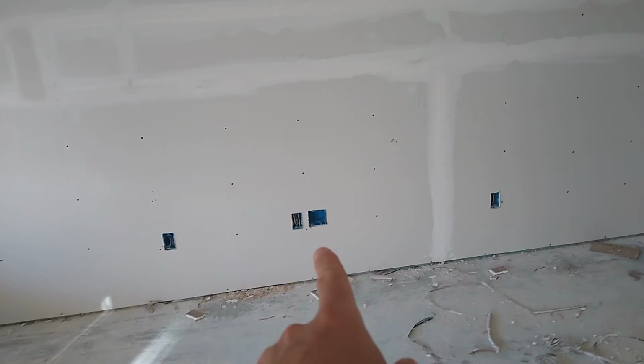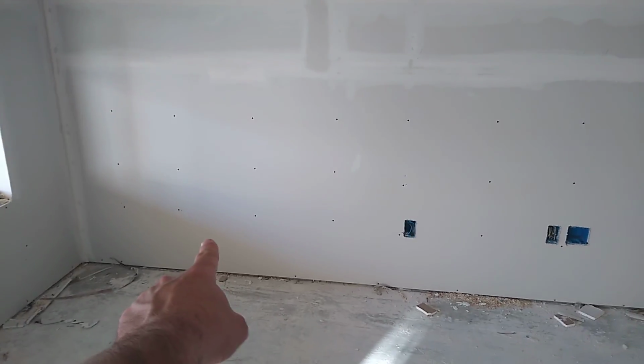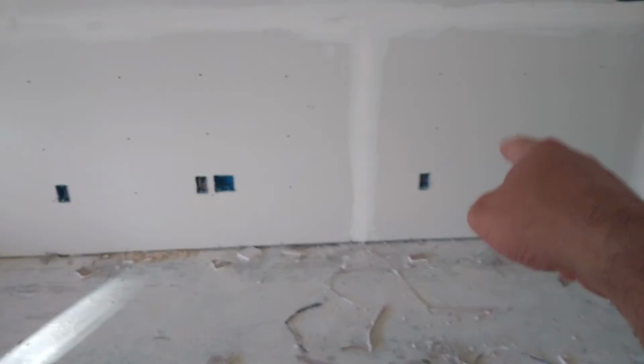This is where I had to move everything, because originally they had this electrical outlet way over here. Again, I need power for the TV, so I moved that electrical outlet from way over there to right over here. And here's the first of my installs, this double box with a 1.5 inch conduit, so I can run surveillance or Cat 7 cable to the other rooms. I think that outlet I left alone. Switches for the room. It's actually looking like a house.